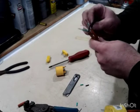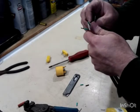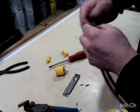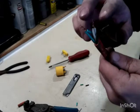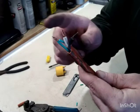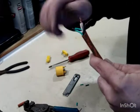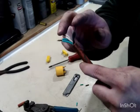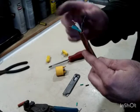All you're going to do is just separate the wires out and try to get the ones as close to each other as possible. Just spin them together. So technically now I've only got three wires carrying your hot, your hot, and your ground. The 220 uses two hot wires and only one ground on a 220 system. Most systems run two hots and one ground — sometimes there's another ground like an earth ground going through, but for this we're just running one ground back and two hots.